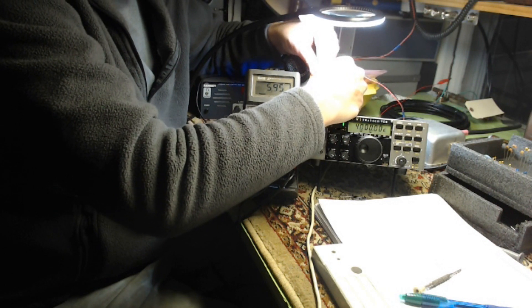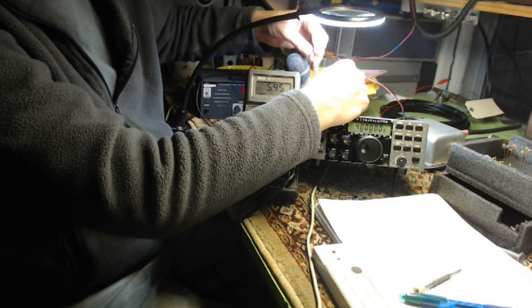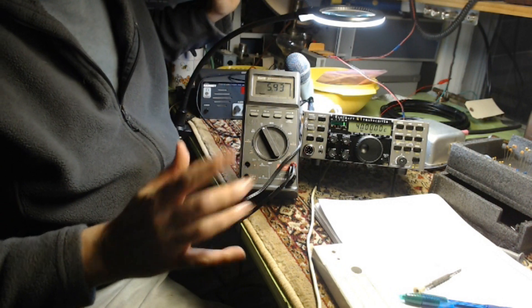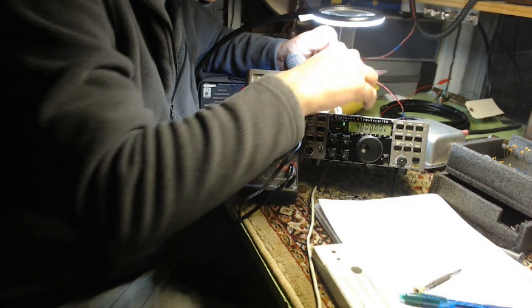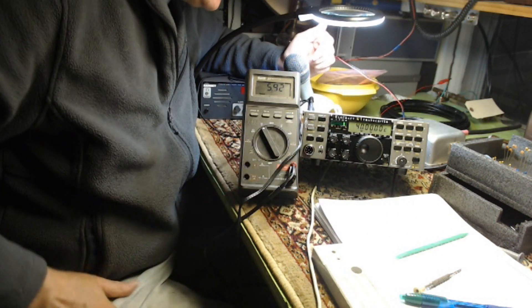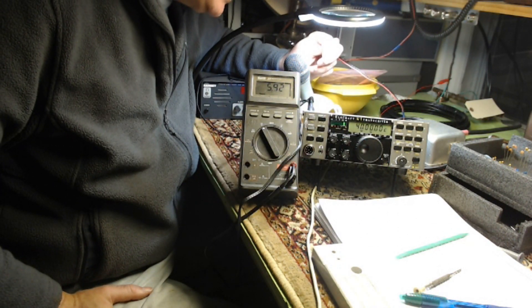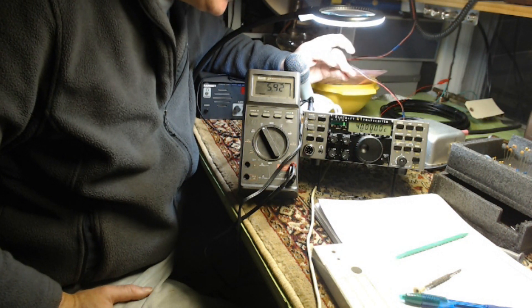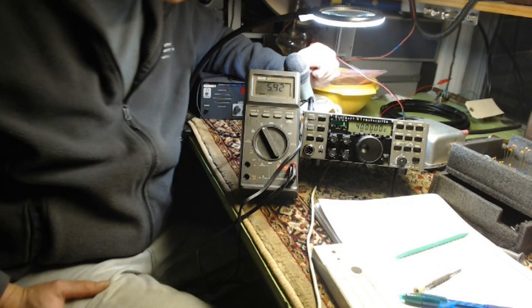Six — come on, you were there. Nine-five. Nine-four. All right, I'm going to stop. I'm going to look at that transformer and recheck my windings, recheck the parts that it told me to check, try it again. And if it doesn't work, I'm going to swap that inductor again with one that I haven't used and go from there.